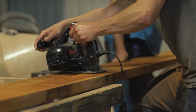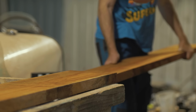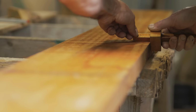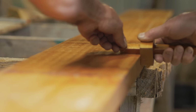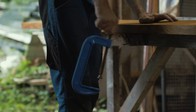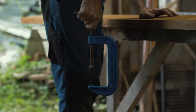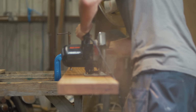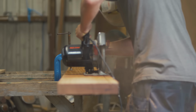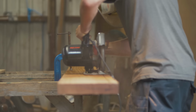So with that length of Sapele timber that we got, we replicated the old gunwale. It's pretty much the same as the port side gunwale, same on the starboard side. And we cut out that rebate to take the double diagonal mahogany, which had been replaced with marine grade plywood, the 30-year guaranteed one, which water got into because, again, it wasn't sealed 100% at the top. It was before I had even started buying and using epoxy. I just did it with regular wood glue or whatever. We're able to replicate the old gunwale, but this time in Sapele timber.